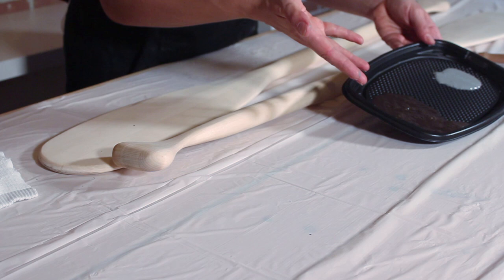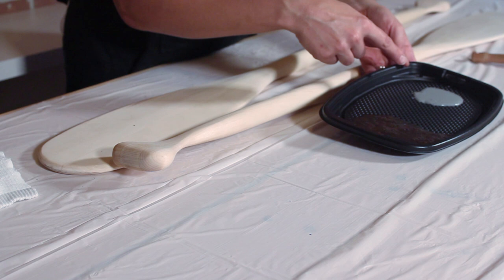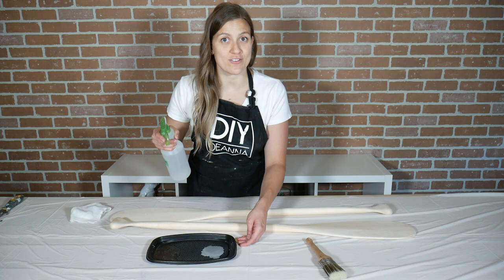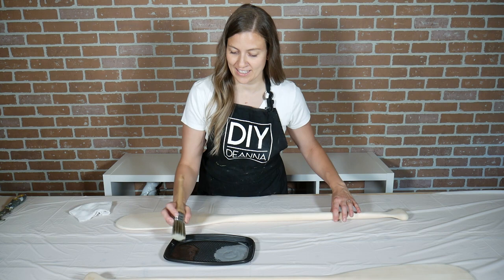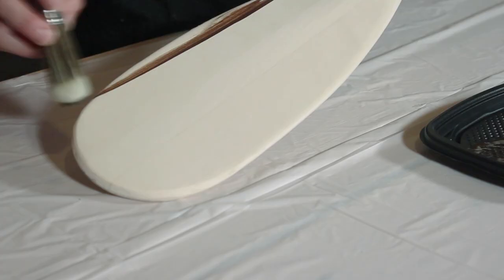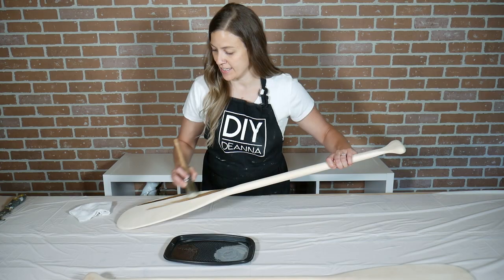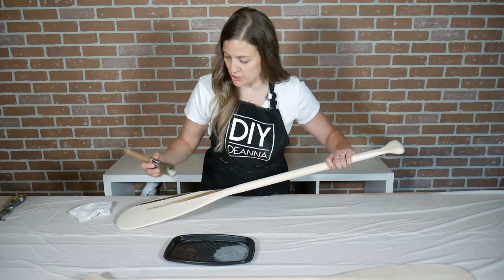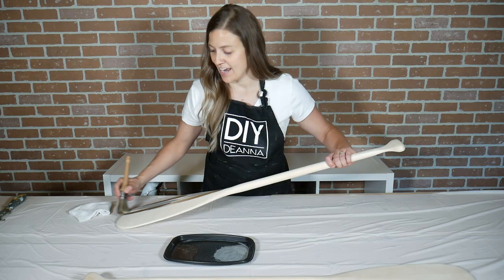I've got a little bit of each product scooped out on my tray. You can see the stain is a little bit runnier — it's a semi-transparent product. Chalk paint is much thicker and more opaque, so I'm going to add a little water to thin it out. I want both products to be semi-transparent so I still see the wood going through when I apply them. I'll dip my brush in the product and just start to paint it on in linear patches following the direction of the wood grain, alternating between colors and randomly brushing it on — and it's okay if they overlap.